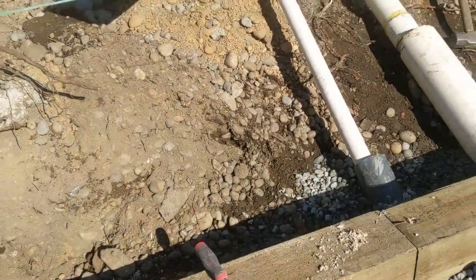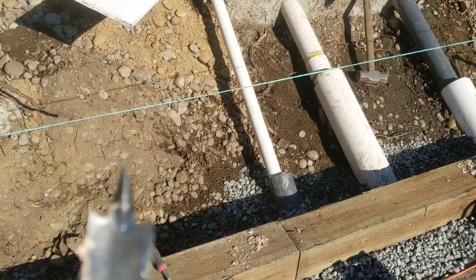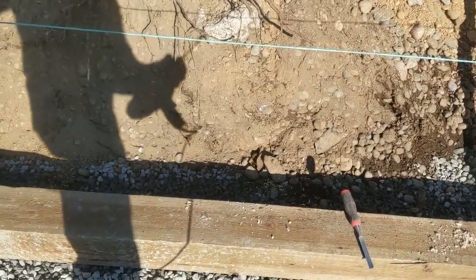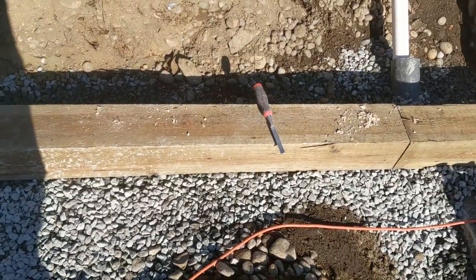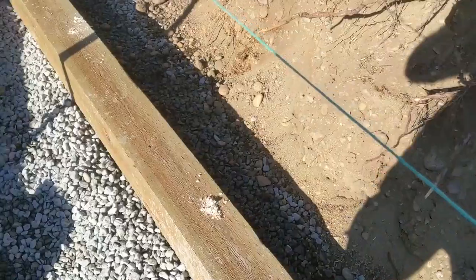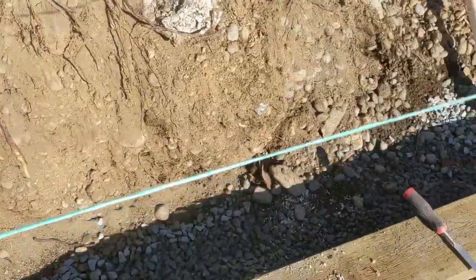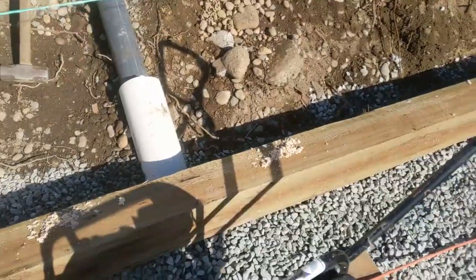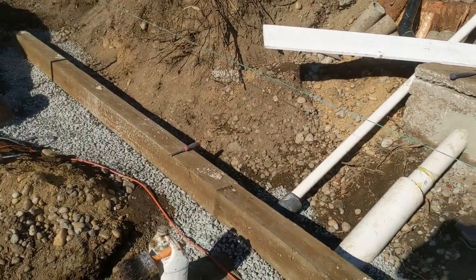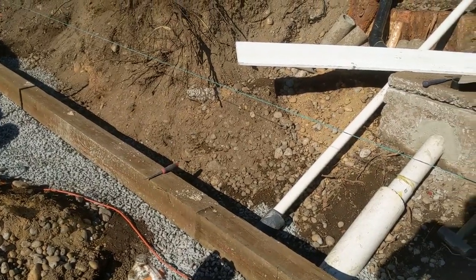What I'm doing here is just drilling — using a five-eighths drill bit and putting a three-quarter inch rebar, that way it goes nice and tight and doesn't move. On the first six by six, first we align it, we level it, we prepare everything, and now we just put the rebar down. Usually I do four to five feet, but in this case the wall is gonna be quite a bit high — about 42 to 48 inches — so we're just gonna put some extra rebar to hold it nice and tight.